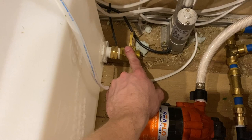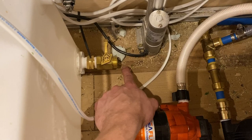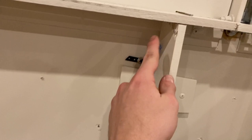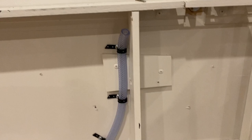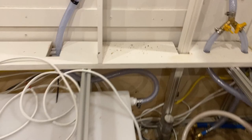A couple of other small things. This is a drain — it's a water hose right now. I'm probably going to replace it with a PEX elbow going out the back, or maybe an elbow going straight to the floor. A lot of people are afraid to put holes in their floor, but I'm happy to do that. And lastly, this last little pipe is an air release — it just goes up to a tube end. That's so as you fill the tank, it lets air out and won't implode or blow up because the air has nowhere to go. You've got to make sure you do that.